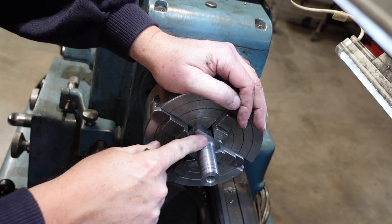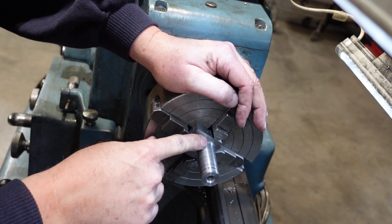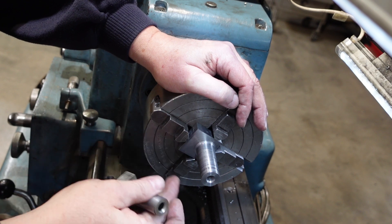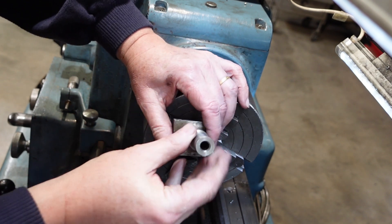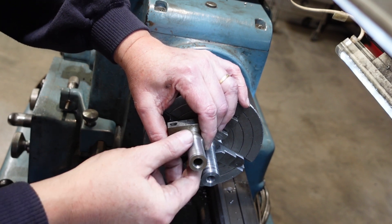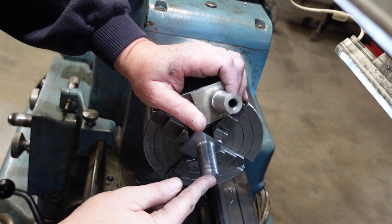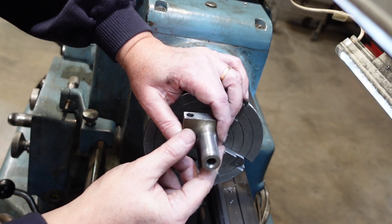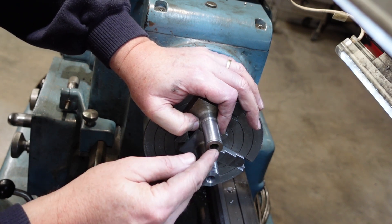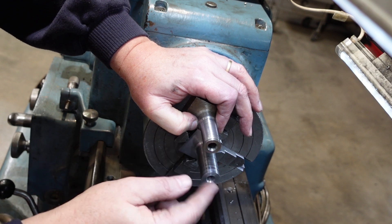Back in the four-jaw again. I've thinned down the base piece so it's the same thickness as the existing part. I've put the through hole in and I've got the tapping hole in the back for the thread — it's actually a 5/16 UNF. One thing I did discover is that there's a countersink there. I thought it would be a 90-degree countersink, but on closer inspection it's actually a 60-degree countersink, which matches nicely with a center. I think the features in here are the same features that would be put in to help manufacture this.